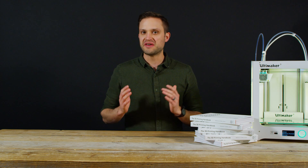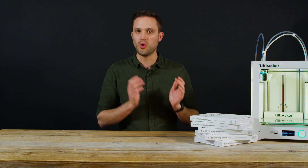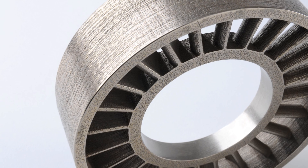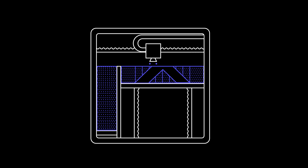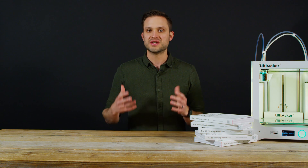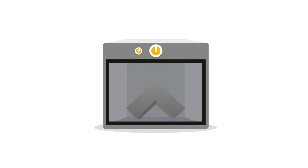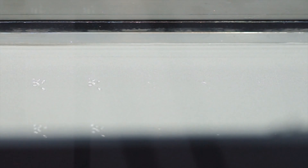There are several other printing technologies that are becoming popular alternatives for producing metal parts that are not DMLS or SLM. Metal binder jetting is one such example — its unique way of producing parts makes it perfect for low to mid-volume production runs. Binder jetting builds parts by depositing a binding agent onto a thin layer of powder through inkjet nozzles and slowly builds the part up one layer at a time. The result is a weak part held together only by the binding agent. To achieve a strong metal part, the print is placed into an oven to burn out the binding agent, then sintered to fuse the metal powder together, resulting in a strong cohesive component.